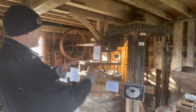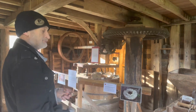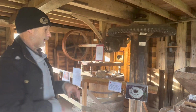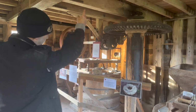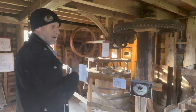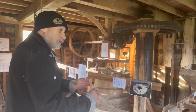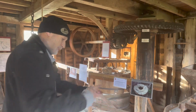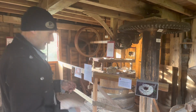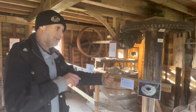I thought, right, all the bearings have got usually four-way adjustments on them, so you can move them east, west, north, south. And I tried all that way, all that way, all that way. But right, I'll do so everything right off. All the 5 different bearings you've got, top and bottom up here, top and bottom there, top and bottom of each stone. Loosen everything off, and I turned the mill about a dozen times, just by hand, turned the wheel, let it go round. I thought, I'll let everything sit where it naturally wants to sit, if it isn't being forced by the bearing adjusters. Did that a dozen or so times round, and just went back and did the adjusters up just to where they contacted and took up the play and didn't actually move it at all.